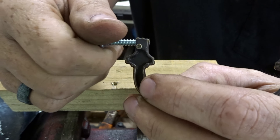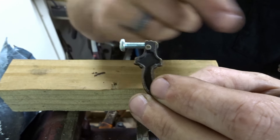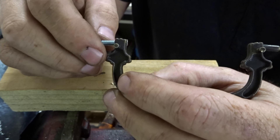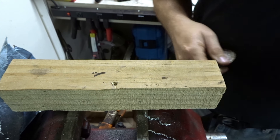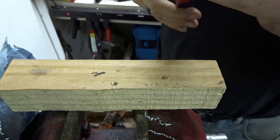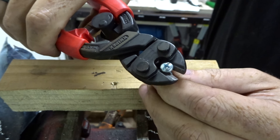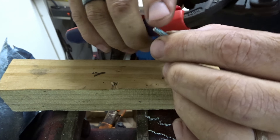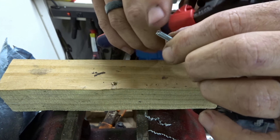Some of my M4s got mixed in with my number 8-32s. So what I'm going to do is measure out about how long that is and then cut it off there. I pretty much just need to cut the head off — you can cut that with a hacksaw, or if you've got a grinding disc you can do it that way. I think one of the fastest ways is just a good pair of dikes. Then I'll just file that down so it's not sharp, and I might want to get rid of those threads anyway — it shouldn't matter, you won't be able to see it.